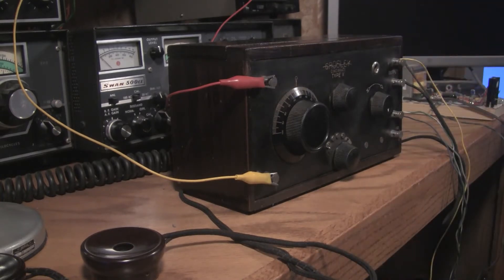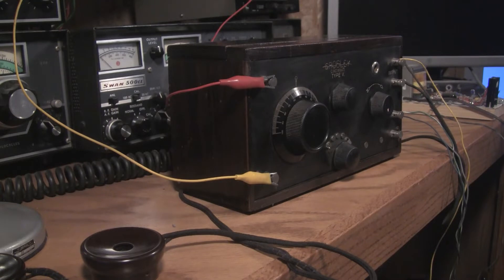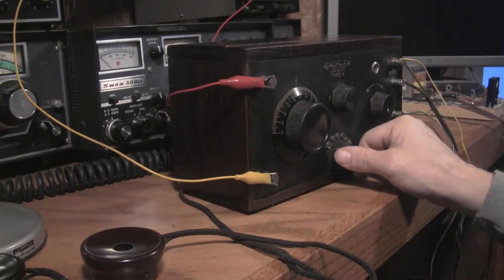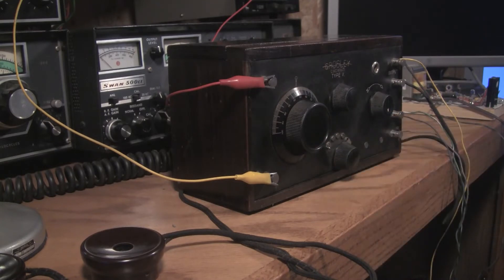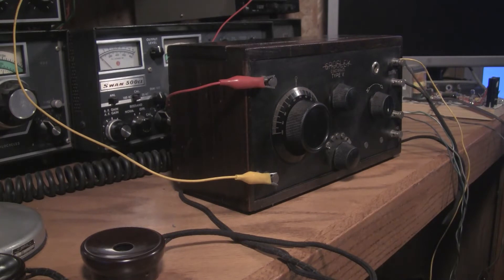I got this thing working. What I had to do is fix many weak electrical connections inside. I put a 1.2 meg resistor underneath the grid leak capacitor because the grid leak resistor was open. There were a lot of other electrical connections including this band tuning switch here, which tunes different parts of the broadcast band. That connection was very weak — there was a splice off of the tuning coil inside that goes to a bus bar, and the wire was just wrapped in there and corroded, so there was no connection. I soldered that.